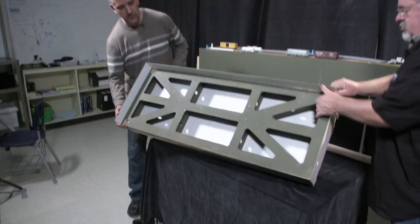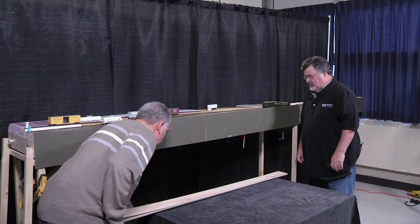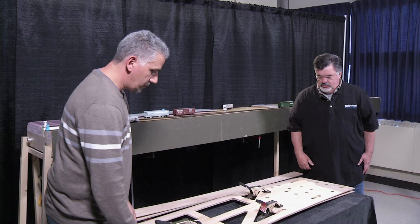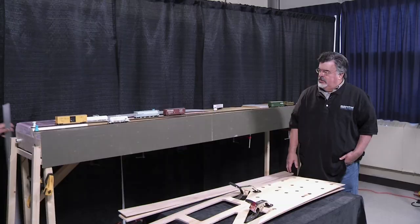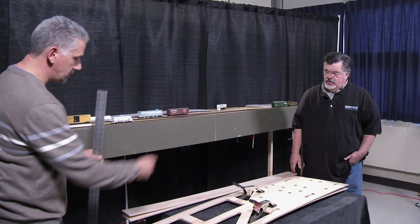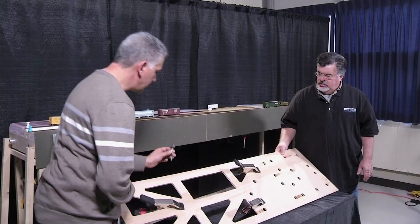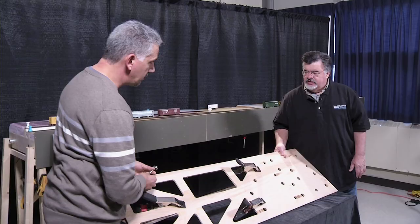How hard is it to cut all this out? I can show you. I started with four-by-eight sheets of plywood, had Home Depot rip them to 18 inches wide. When I got home, I took the excess and made it three and a half inches for the ribbing. I took my drywall square, laid it down the sides, marked the ribbing out in pencil across and with some angles, then drilled the holes for the jigsaw. I used a Forstner bit — really good for cutting the holes, better than a hole saw in terms of giving a nice clean cut.